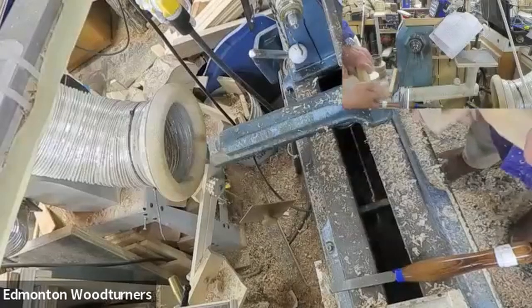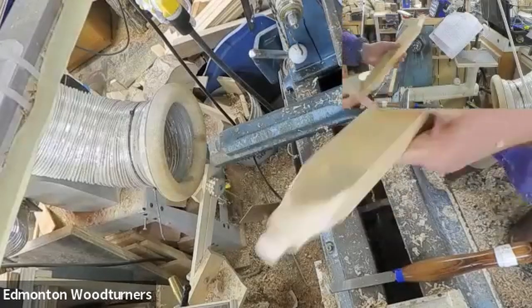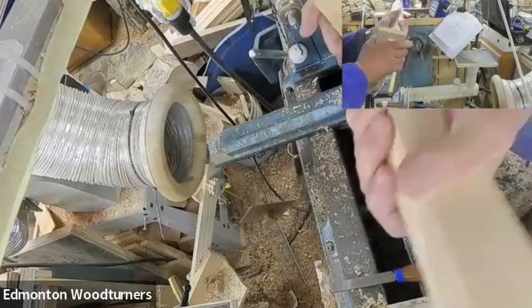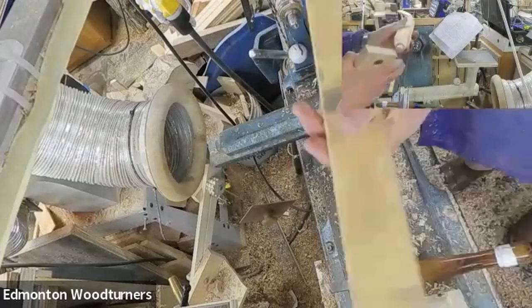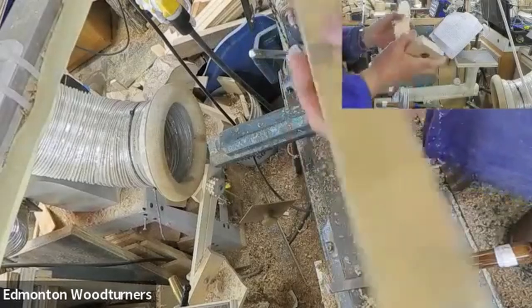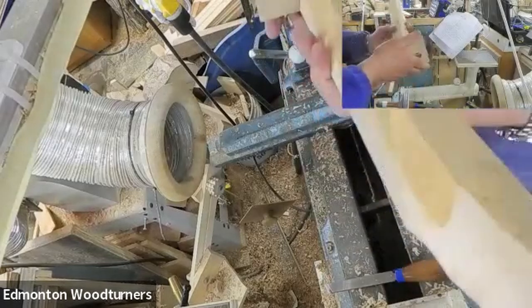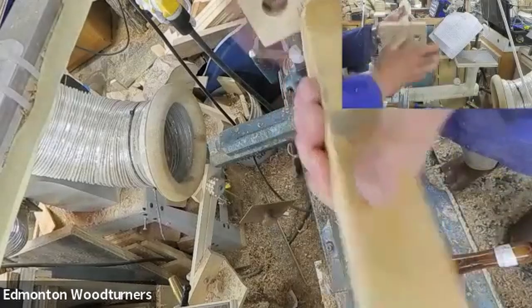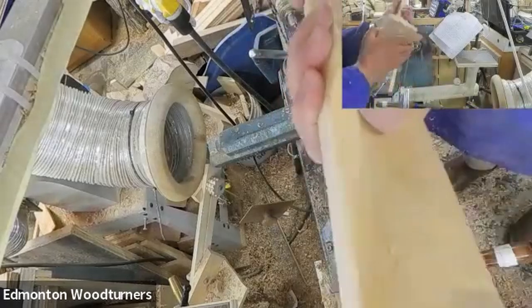Thank you. And if the fit was really too loose, there, that'll go in. That one will go in. It's a little bit tighter than I normally do, but it would still work. And when I'm doing 8 or 10 of them, I would probably call that good because I can put a little bit of glue on there and slam it in. It goes in a little easier once it's been pushed in there once. So that's kind of the fit. It's not tight, but it's not loose.